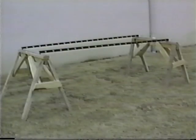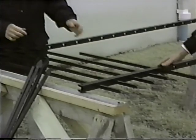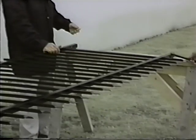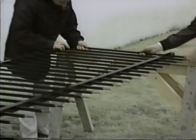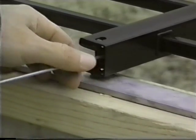With the rails positioned on the jig, pickets are inserted by sliding them through the rails until the hole in the picket just passes inside the rail. Insertion is facilitated by the wax-impregnated surface of the grommets and proceeds to completion within a matter of minutes. The galvanized retaining rod is inserted as the final step of panel assembly.